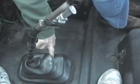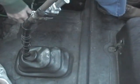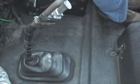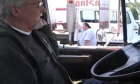I'm going to make sure my rubber boot is securely mounted to the floorboard. It's not cracked or damaged to where fumes would be emitted into the cab. I'm going to stick my hand between the driver's seat and the door. This is my fire extinguisher. I'd make sure it's fully charged and up to date.